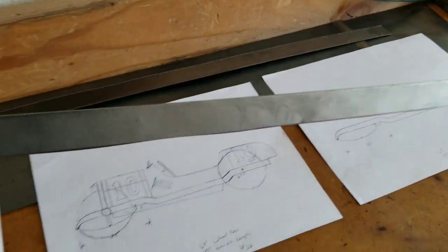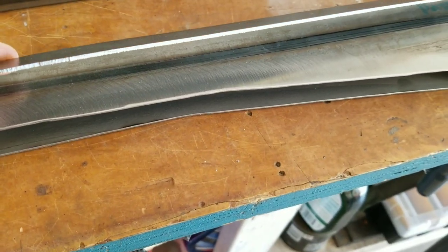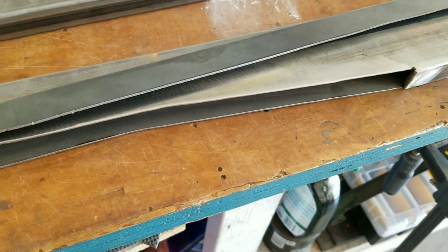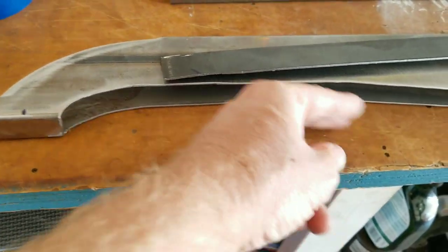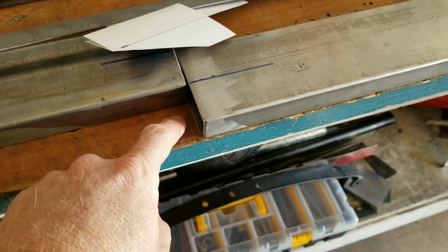I've got some one-inch filler material that has to go in here. I got some flat sheets and went over to Dennis Thomas's house — he kindly let me use his band saw — so we cut some one-inch strips of 16 gauge steel. I'll fill that in later, holding off until the pipe bit is put in at this point and then continuing so it all becomes one piece. Next I'm going to cut these wedges, weld this part of the frame, and then do the same treatment on the other side.